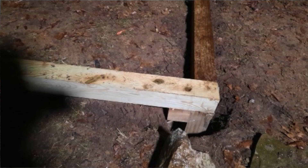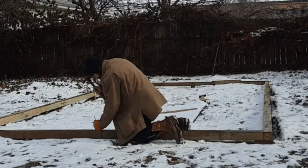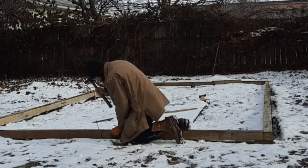It was a post-and-beam type foundation — posts set in the ground with beams running across those posts, with gravel in the holes to lock everything in. When I went to get the permits and submitted the application, the city wanted concrete foundations, a concrete floor, rat wall, and the walls and rafters in the kit weren't to the thickness they required.